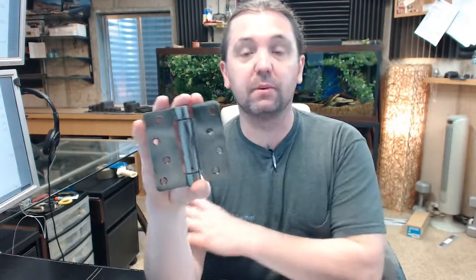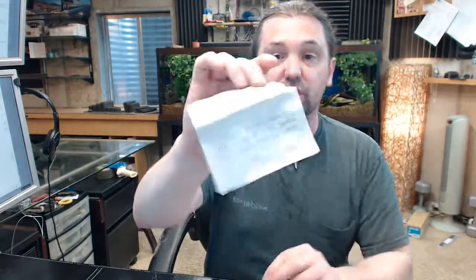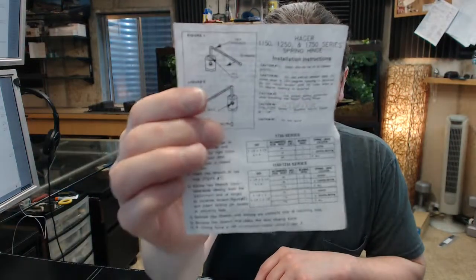Now let's move on to how many of these hinges you need. It's very likely you're buying this to replace existing hinges, though it's certainly possible you're doing a new installation — in that case, the location of the screw holes is secondary, as you'll prep the door to account for where they'll be located. Included in your package are installation instructions along with a diagram for setting the tension, which we'll get to in a moment. You can review that installation instruction link before, during, or after your purchase.